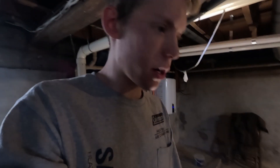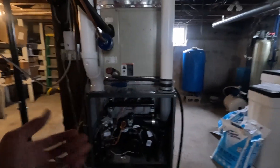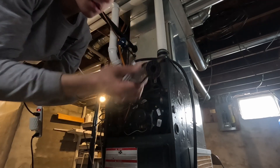Next we're going to throw in those new burners — I'll show you what the old ones look like. It is actually running, and you can see there's quite a bit of crusty stuff on the heat exchangers. We'll go ahead and shut this thing off. We just have to pull these four screws, pop this out, and then each of these lifts out. That's one thing I really love about Goodman — they've got a really good burner design. The flame sensor on some Goodmans is mounted here so you can actually get at that screw, which is nice, but not on this one. Here's our new burner, and here's the old crusty one out.